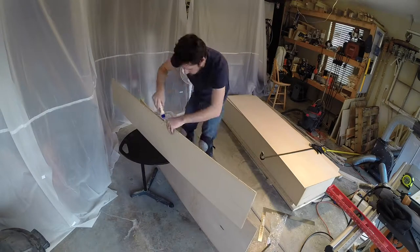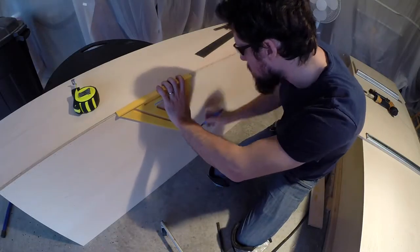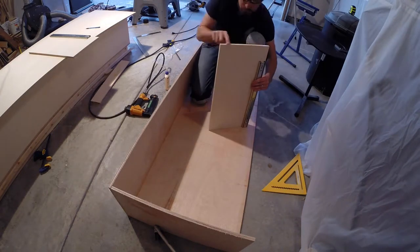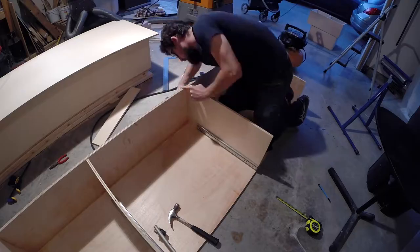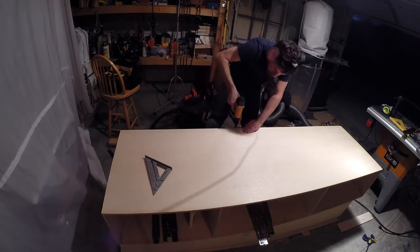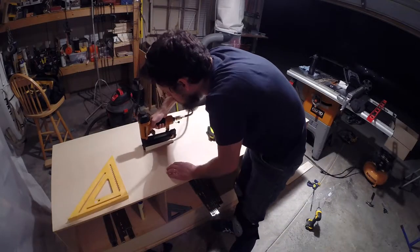The bed was held together the same way the drawers were, with glue and nails. Take your time lining all of this up — I had a small laptop stand that was a huge help with holding the sides up to the correct height. I measured where the inner supports and drawer slides would need to go based on the width of the drawers; each slide was half inch wide, so I had to account for that in my measurements. When marking my lines for the supports, I used a few different straight edges to carry my lines all the way around the platform, helping keep the support square on the inside and showing me where to put my nails on the outside. Once they were glued and nailed on two sides, I flipped it over and added the top. I made the second platform oriented exactly the same way as the first when it needed to be a mirror image, so I had to flip it over and reattach the drawer slides in the correct place. If I were doing this again, I would wait on adding the slides until after the boxes were completely put together — trying to get everything square with the slides in place was a little tricky.